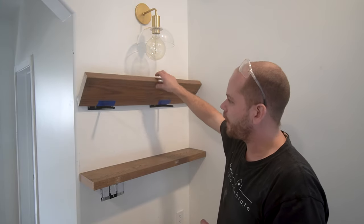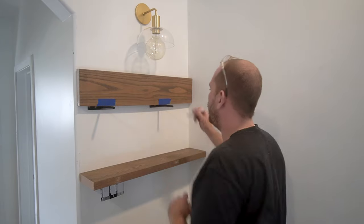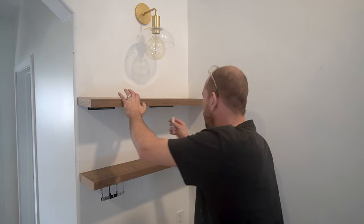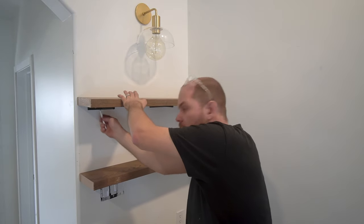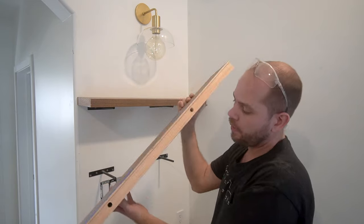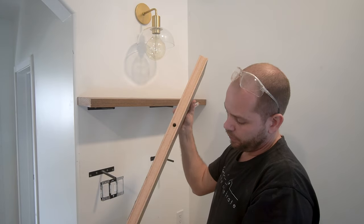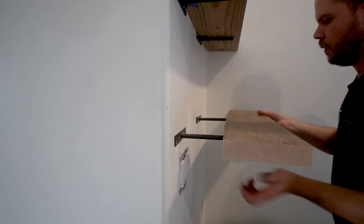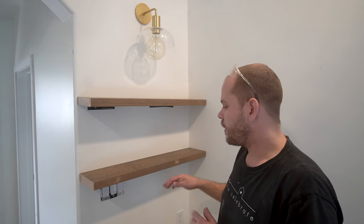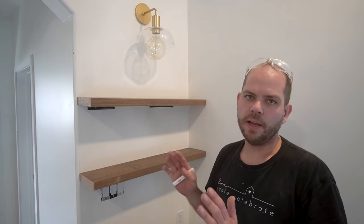Once I had the shelves fitting well, the next step is to locate the brackets on your board. I put a piece of tape on the bottom face and added marks to show where the brackets sat in relation to the back of the board. Then you can drill holes — a one inch wide by an eighth inch deep router groove, with half inch holes drilled through — so it just slides nicely onto the bracket. This step-by-step process of cutting the end, the back, and scribing gives a really nice tight fit and hides any play or variation in your walls.